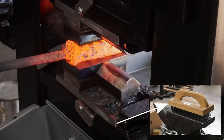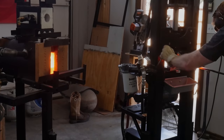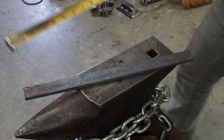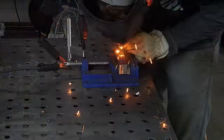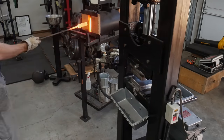Lastly, I used the butcher block brush to brush off scale. I did this more diligently towards the end of the process and found it to work very well. I then got lazy when forging the blade and found a significant amount of scale buildup, which resulted in more grinding and a thinner knife. I'll put a link to the butcher block brush in the description below.